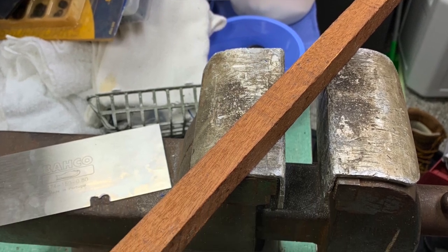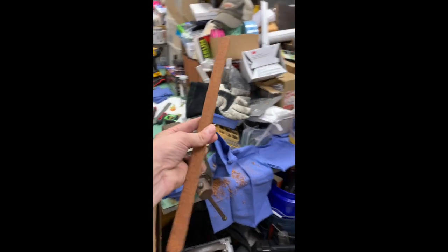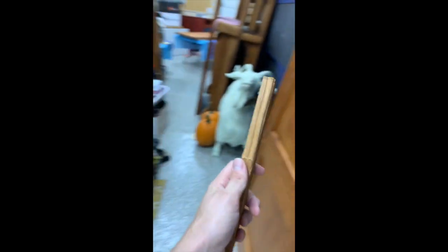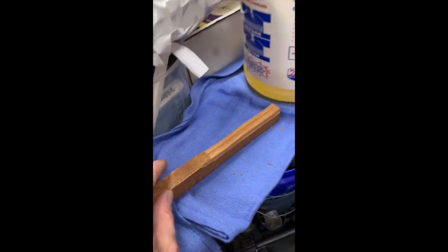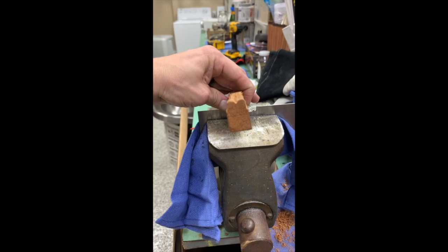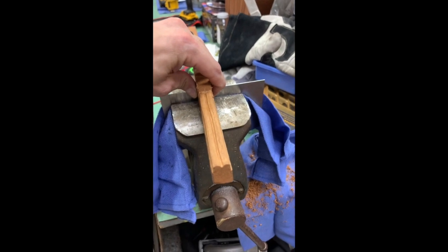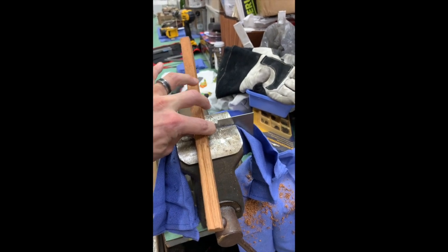I've already made one of them. I took a stock piece of maple — I thought the color was similar to the door. You take that Swedish steel... this is the first one I did, and I'm going to have to redo it. If I take this piece and set it down here, you can really see — looking at the end profile — how I've made that piece of trim. But there's a bit of a wave in that piece; it's just not as straight as I'd like. So I'm going to do it again on probably the other end of this board.